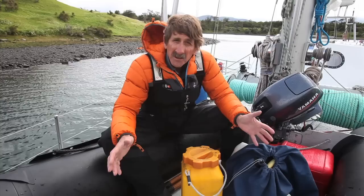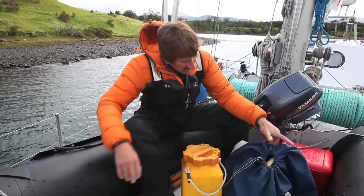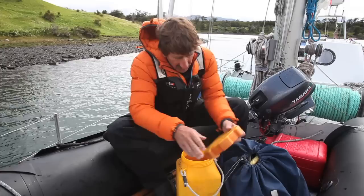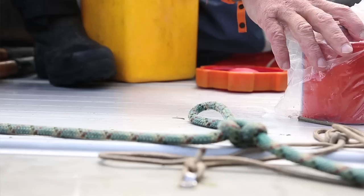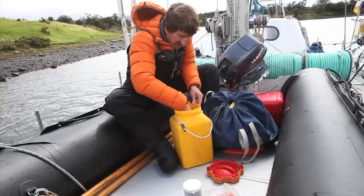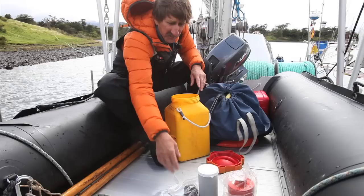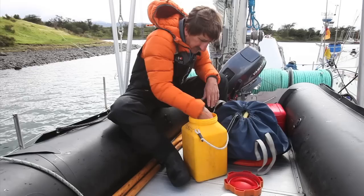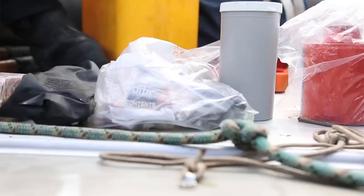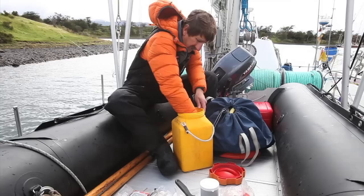Equally important are the contents of the dinghy — what you actually carry for every trip ashore in these remote areas. We've got oars and a couple of paddles. We've got a bag with an anchor and a line, and also a pump in case you have a deflation problem. Then we've got what we call the dinghy kit — a waterproof plastic box with a whole bunch of interesting stuff in case you get stranded or have a problem. We've got an orange smoke flare, a repair kit with pieces of rubber and glue, a VHF radio with fresh alkaline batteries, a spare spark plug and tool kit, fire starters and matches, red parachute flares, a knife, and a flashlight with separate batteries — kept separate so they stay fresh.